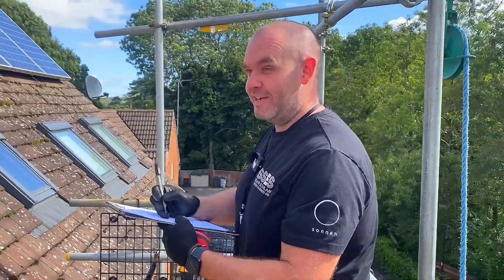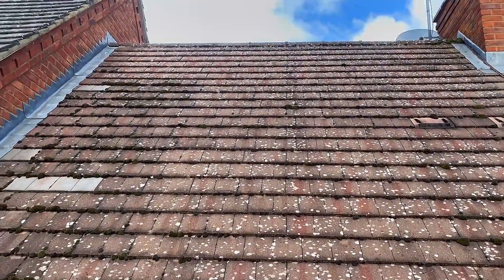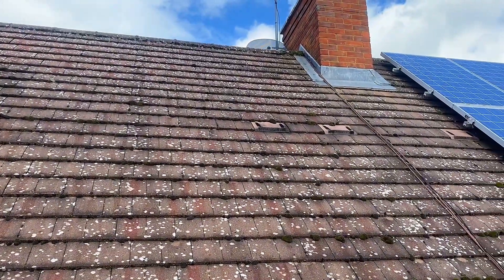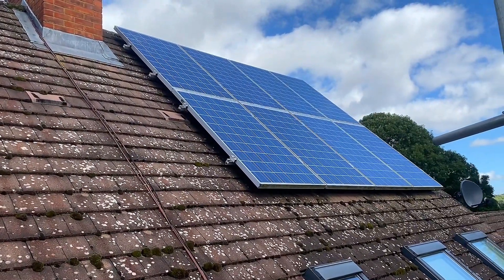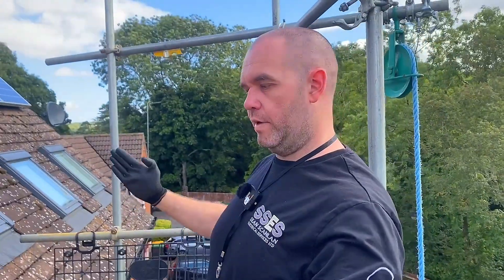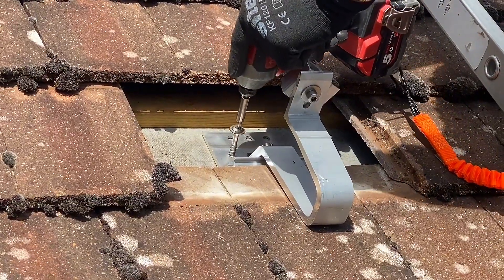The roof pitch is 40 degrees. We're trying to find the area — once we know that, we can work out the panel size and how many we can get on there, allowing for the gaps we have to leave from the ridge and from the sides. Looking at the neighbour's installation, those gaps are purposely left. Ideally the panels should be pulled down a little from the top because you have to think about wind lift, which is why we bring them in between 500 and 600mm all the way around.